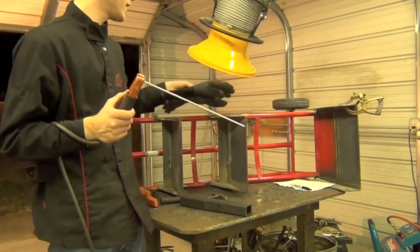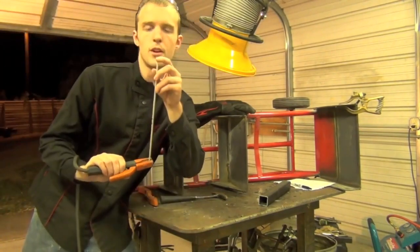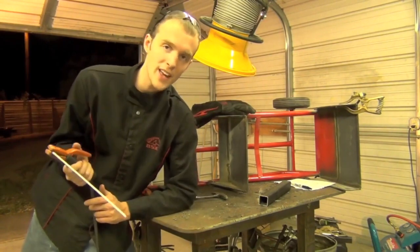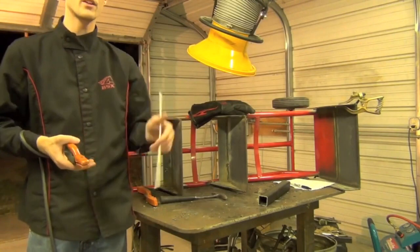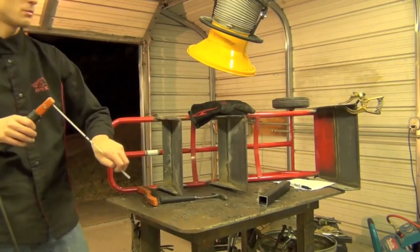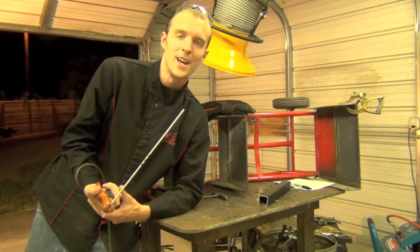Tip number 13 deals with striking an electrode that really isn't in the mood to be struck. When you're running a 7018 or other low-hydrogen stick electrodes, sometimes a little ball of slag forms over the steel part of the electrode tip. If you try to strike it a few times and it's not working, here's what you do: with gloves on, take the electrode and rub it against a rough surface — a file, a concrete floor, or a piece of steel with rust on it. That should pop the ball of slag off, exposing bare metal to complete the circuit, and hopefully you'll be back to welding.